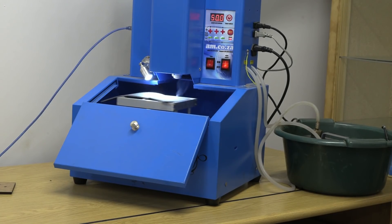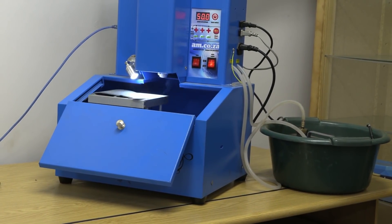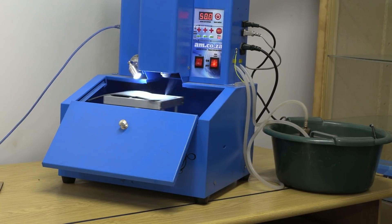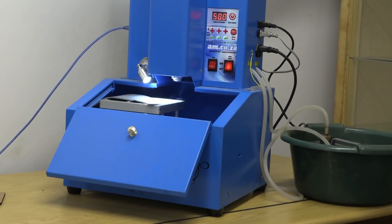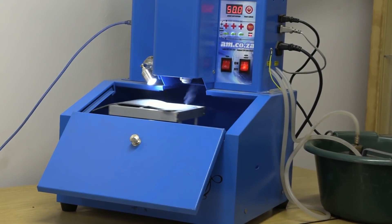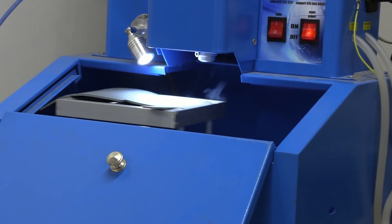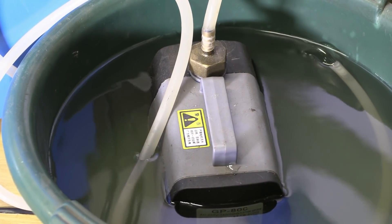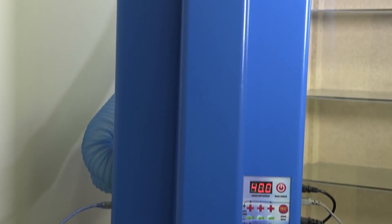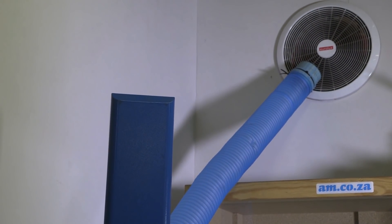The TrueCut Vertical Laser Machine is a great choice for fast and easy storefront customized rubber stamp making, and available for purchase from am.co.za today. The machine is currently the lowest cost machine of its kind on the market for rubber stamp making and has the lowest running cost as well. Our TrueCut Light Vertical Laser Machine includes a water pump that provides cooling for the laser tube, and it also has a built-in extractor fan to remove the smoke caused by the laser burning the material. The extractor fan tube is also included.